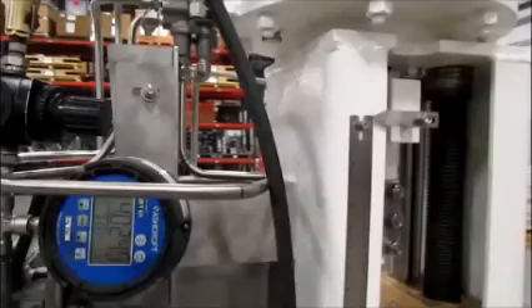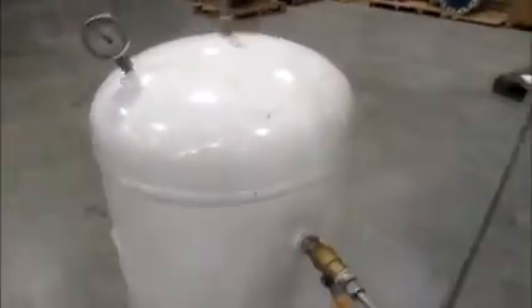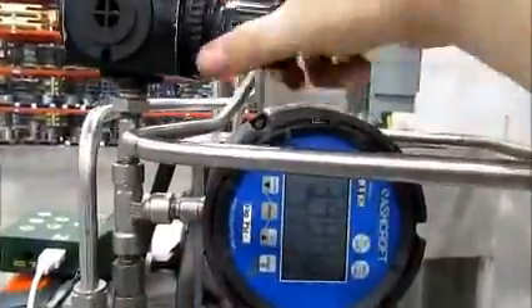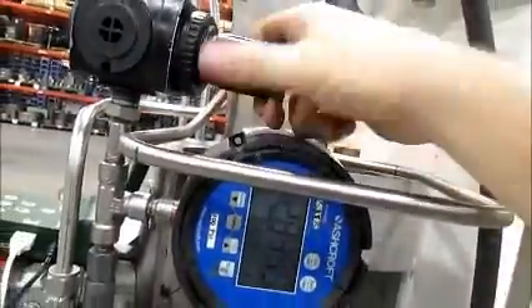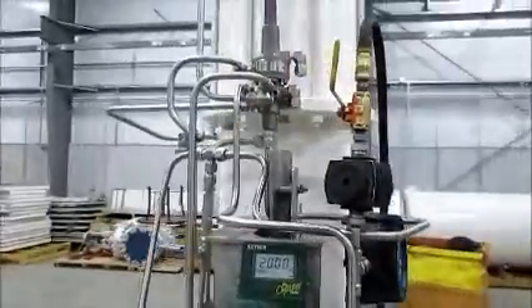For the last demonstration, we're going to show the actuator fail on complete loss of air supply. Once we lose the air supply, we're going to lose our pilot signal to the trip valve, and it's going to let our isolated air fill system dump air on our designated fail port. It'll take a little while to vent, but once the trip point hits in the trip valve, air should start moving pretty quickly and we'll get our valve closed.